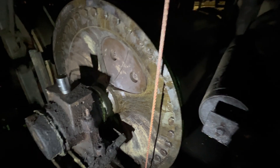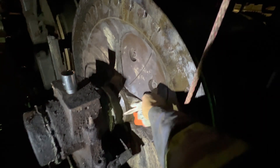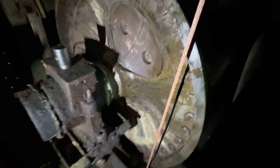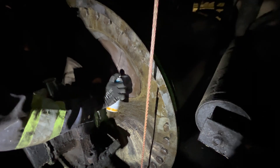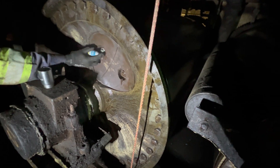We're making a video of this. This is a steam can. We're replacing a manhole gasket. We're going to loosen these bolts — usually you need a pipe — and spray it with penetrating oil because it's been there for years and gets cranked hot from the steam.